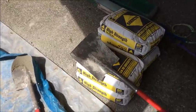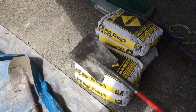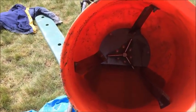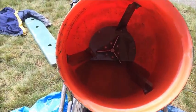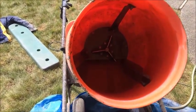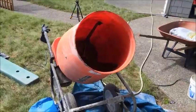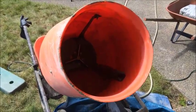I've now gone down to 60-pound bags, which I think is easier. What I'm going to show you is adding it a little bit at a time. I've already got three-quarters of the water needed in here. For two 60-pound bags it would be five quarts; for two 80-pound bags it would be seven quarts. I've got three-quarters added already, and then I'm going to shovel it in one bit at a time — that makes the whole process go a lot faster and smoothly. Then I'll show you how to add the concrete aggregate.